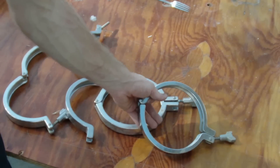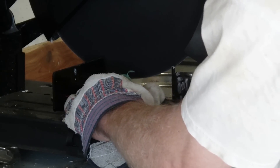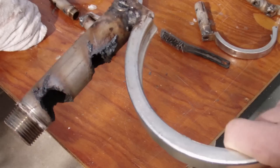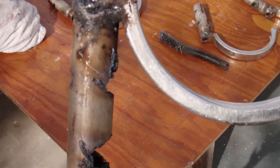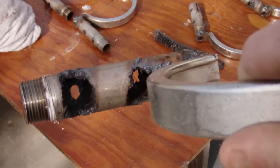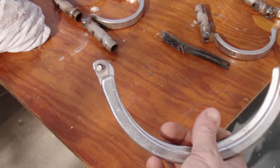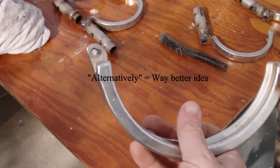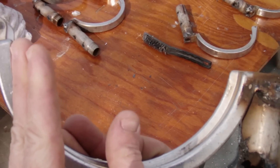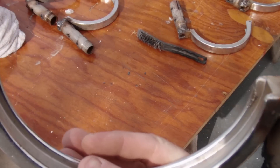The inner diameter of these is approximately 6 inches. These gutter hangers space the gutter out a bit from the edge of the board — they've got large holes to accept everything you need to fasten the screw through. They're awfully sturdy. Alternatively, if you wanted to spend a little more time cutting, you could cut the pipe at an angle and weld it flush, giving you less of a gap between the angle bracket and the gutter. Or you could even weld it downward and chop the excess off, which would leave you pretty flush to the side of the house.